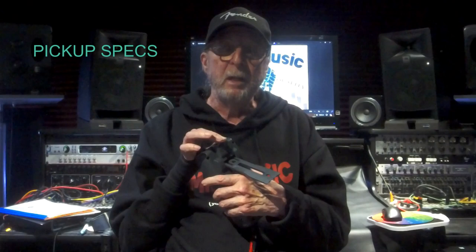I wanted to add that I use a DE5000 LCR meter, and I can keep a record of every pickup I make. It has a USB port to your PC, and you can export everything into Excel and keep a record of every spec of every pickup you make. This goes into real heavy specifications, not just your K-ohms and your Henrys. It does capacitance and your RP, which is parallel resistance. I don't know why it's called RP, it should be PR, but I don't make the rules. And there are two or three other little settings in there, and you can go all the way from 10 up to 100K on it. So you keep great records of your pickups and your builds.